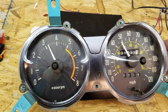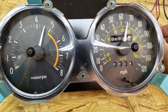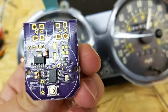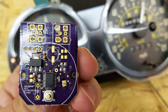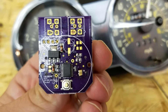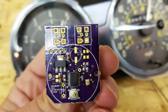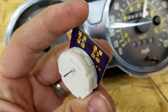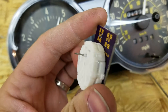I've got a stepper motor behind these gauge faces that I've installed in there, using the factory mounts and stuff that was in there. This is a little module here that I built. On there a MSP430 is the main computer chip. There's really very few components on here — a power supply or voltage regulator, a diode, a reset switch. This is a G2553 that I have on there. It's a Switec motor on the back, used in pretty much every GM car for many, many years. I got them on eBay — they're like a dollar a piece.